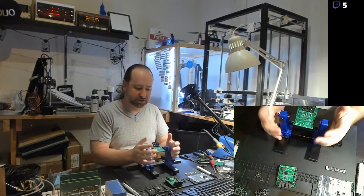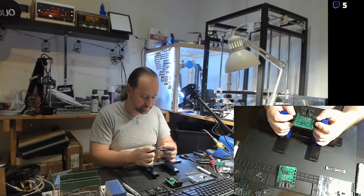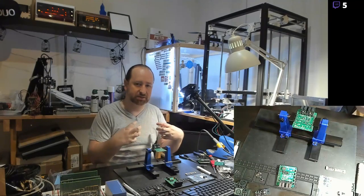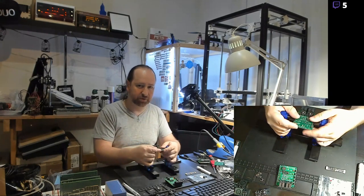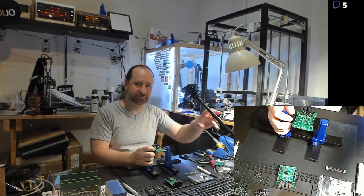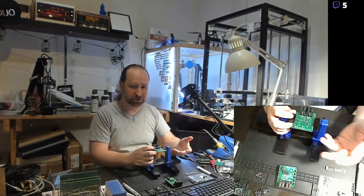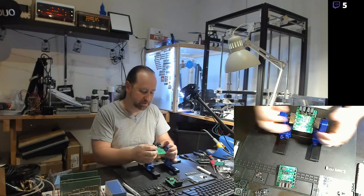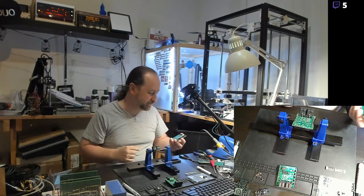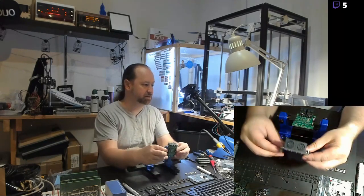These boards that I'm building here are actually Commodore 64 floppy drive emulator boards. They connect to a Raspberry Pi, and the Raspberry Pi fully emulates a Commodore 64 1541 floppy drive and all the hardware in it, and uses this board to connect, so you can have nice disk images. Just throw them on an SD card, pop it in here, and you can boot up an original Commodore 64 with any disk images you want, and they run fast. Actually, it runs really nice. I've got a few of these boards that I'm building to give away to friends that have Commodores once I get all the pieces in.